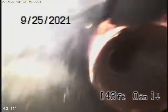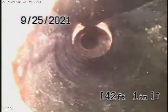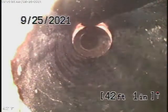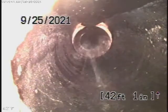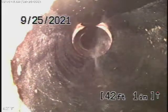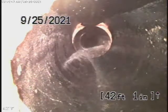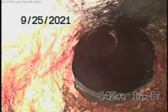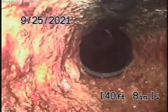It's going to change to ABS here. We're going to recommend that this section of piping be replaced and fixed properly, because there's no way to clean this. If you have a blockage in the house, that clean-out out in the front is not going to be able to help you. You'll have to come under the house to release the cap, and you'll have sewage under the house. So we're going to recommend that this section from here to the clean-out be replaced.